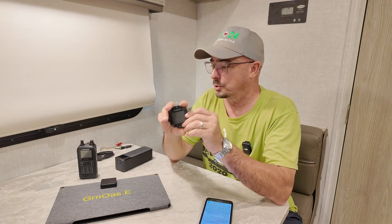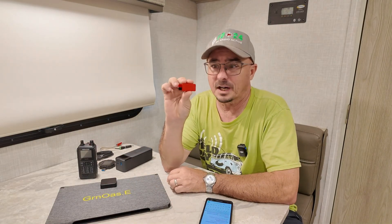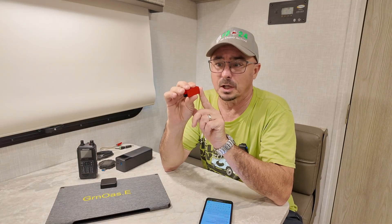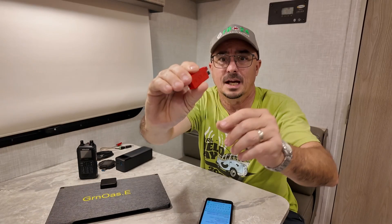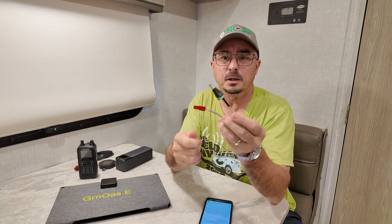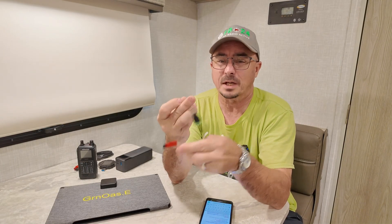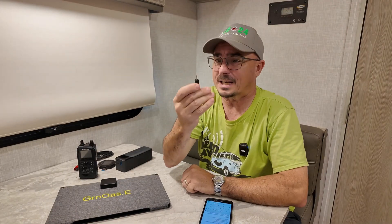In order to use this solar panel with USB-C to give you 12 volts, you do have to trick the panel, and there are a couple of different ways to go about that. First is this little device here — I'll leave a link down in the description below — you simply feed USB-C into one end of it and you will get 12 volts coming off of the power poles. If you go that route, you will also have to make up a cable with power poles on one end and a standard 5.5 by 2.1 barrel connector on the other. I use these little barrel adapters depending on which radio I need to charge.